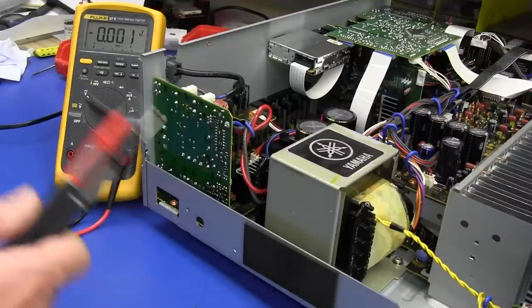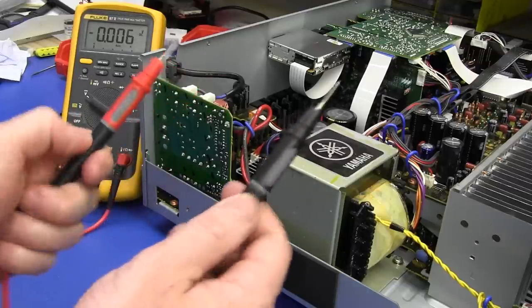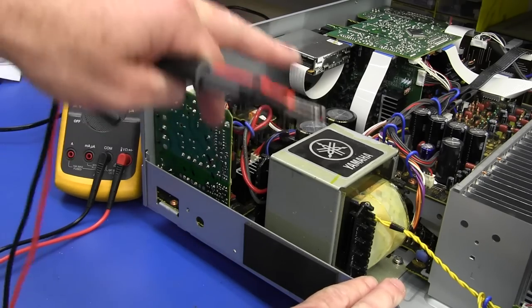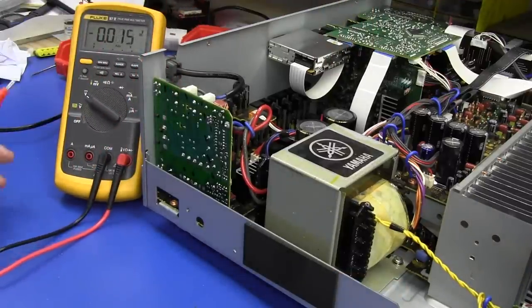Now I've got this thing powered up - and this is immediately very dangerous when you're working on live gear like this. You should ideally have a mains isolation transformer. You also need a residual earth leakage circuit breaker in your box, and you always work one hand - keep the other in your pocket when you probe. In a mains earthed device, if you're casually leaning against it and poke around inside, you can kill yourself. Just be careful.